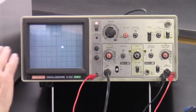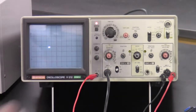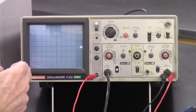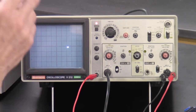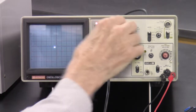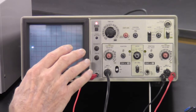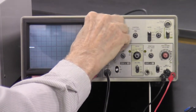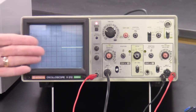When the dot gets to the right side of the screen, it shuts off and jumps back to zero voltage, then sweeps across linearly again. The sawtooth wave generator is generating, if calibrated, one-tenth of a second per division — so it should take one-tenth of a second times ten divisions, or one second, to go across the screen. As you turn the sweep speed faster and faster, the dot goes across the screen quickly due to the persistence of your eye and also the persistence of the phosphor on the back of the screen.